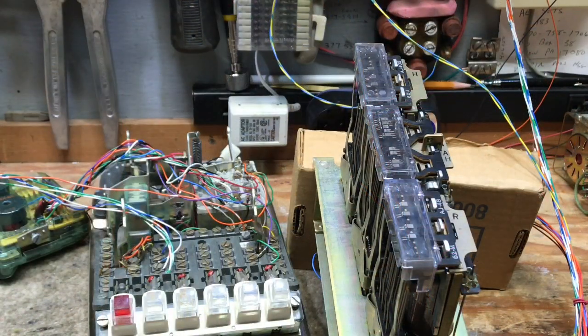For this portion of the video, I will demonstrate how the 1A1 line unit operates. The same exact theory will be on the 400 series line cards. Due to the miniature wire spring relays on the line cards, they're very difficult to actually see them operate without a camera with a very good lens.